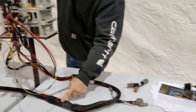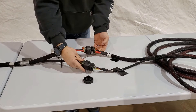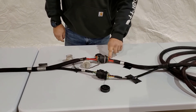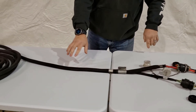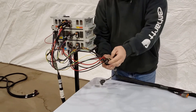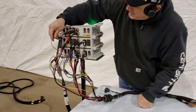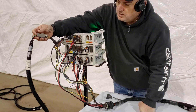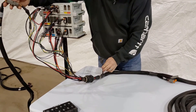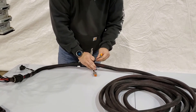We'll follow back through to our ECU breakout — that T — and follow to the back of the front implement harness. Once again we come back to our harnesses with the ISO connection and high current power. Following through, we come to our next ECU breakout. Same structure as the last: pins 8, 12, and 16 as your power, same splice off for three ECUs, same pin one power splicing off, and the same for your switch box. This switch box power splices off and goes to power your rear terminator on your rear harness. You also have your auxiliary power — two powers going there, spliced off — and power going to the whisker switch.